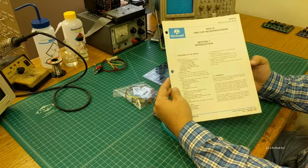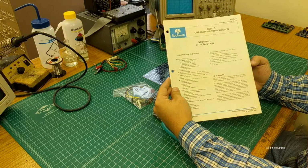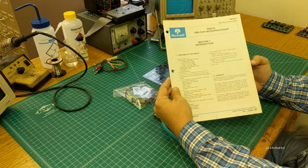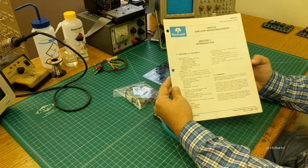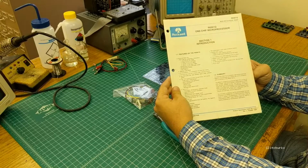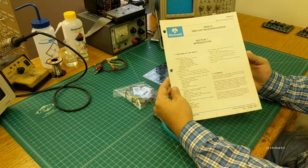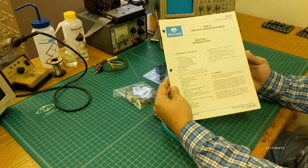The main thing that really throws 6502 code off is that zero page contains registers for the I/O devices, the internal processor registers, and also contains the stack. So instead of being on page 1, stack is down in page 0, and page 0 is all internal RAM, and there's only 192 bytes of it. So modifying software for it's a little bit of work.